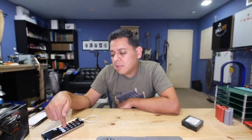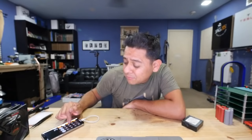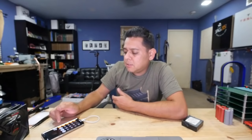And then I have 5 of the 3400 milliamp hour cells, right? So 3.4 times 5? I think I do have 5. Or 4. 5? I think it's 5. Anyways, if it was 5, that would be 17 amp hours. Right? And so I'm trying to load them, 48 divided by 17. Yeah, so I'm doing 2.8C. Almost 3C on those batteries, right?